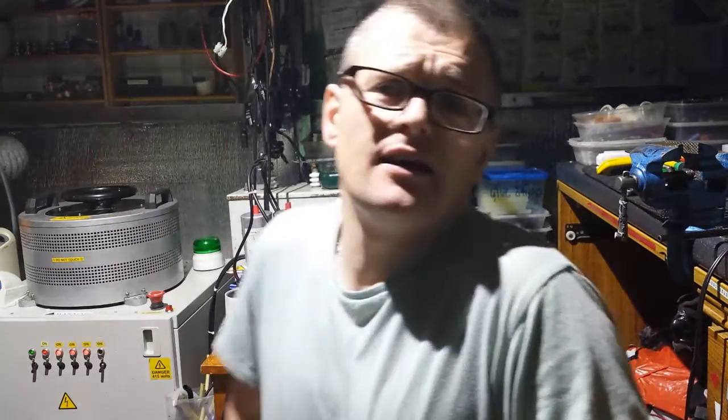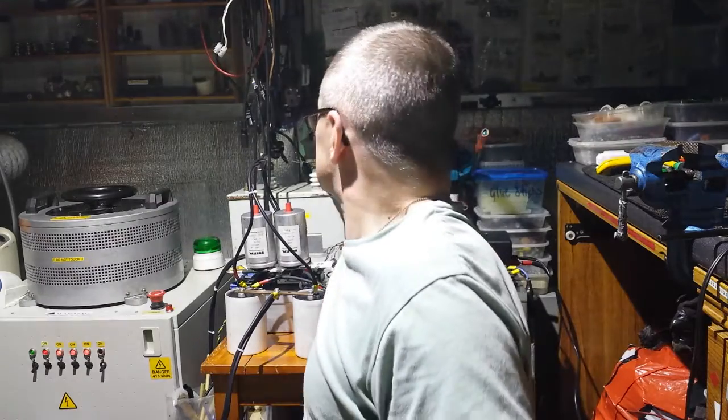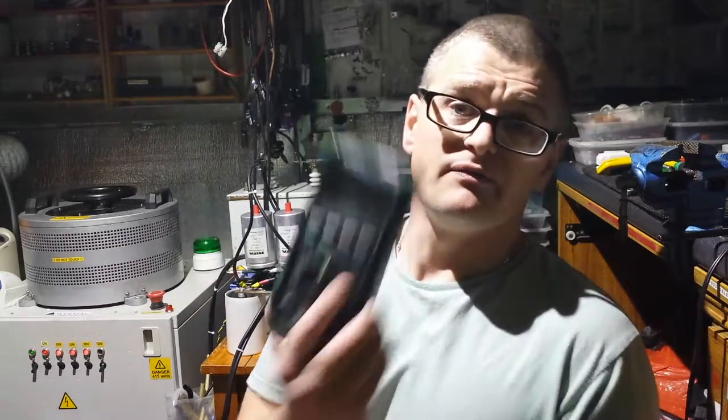How are the muggle friends of YouTube? This video is a big badass of a homemade flyback, and I'm going to be running it off a half bridge IGBT. Let's see how it goes - it might be crap, it might be good, we don't know. I have actually been messing about with the primary windings on the ZVS driver, adding and taking windings off to see the best way that it runs. It runs better with around 4-6 windings. I need to put it on the scope and frequency meter to check the frequency.